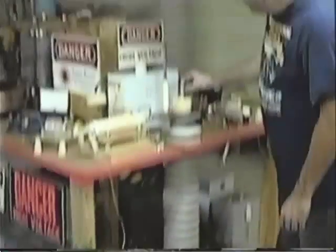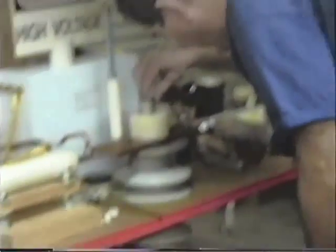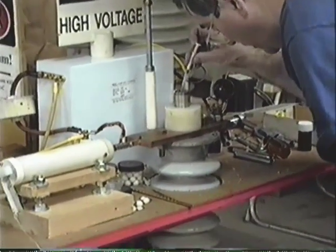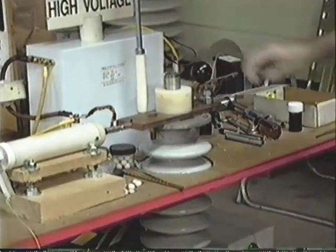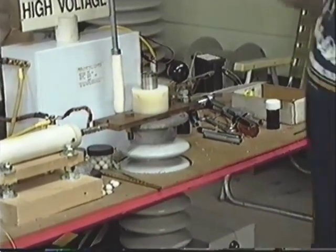I'll place a ball in the gun and let it fall in just far enough to seat itself on the water. I'll make sure it evacuated out — because you don't want any water above the ball, because water being an incompressible medium would actually slow the ball down.